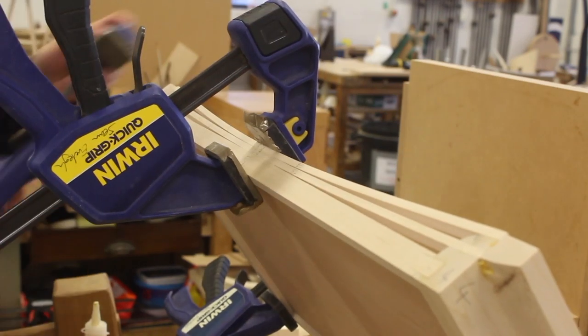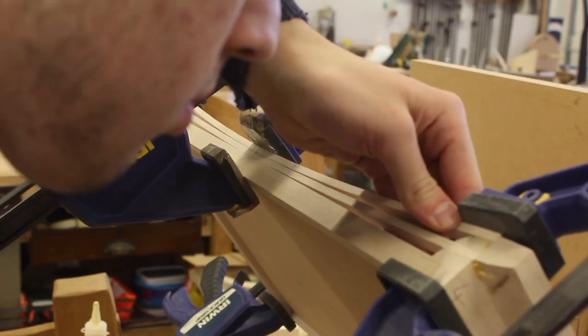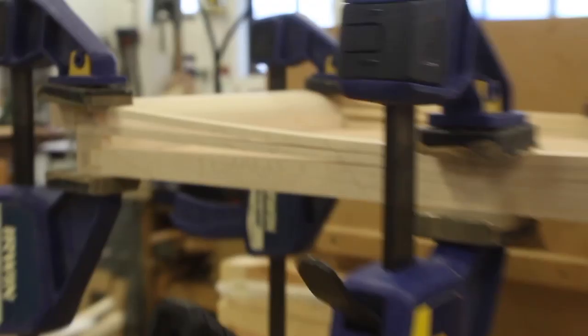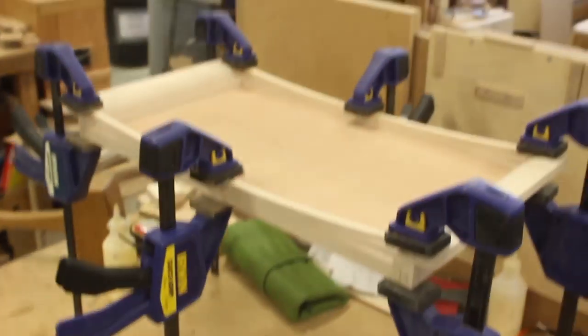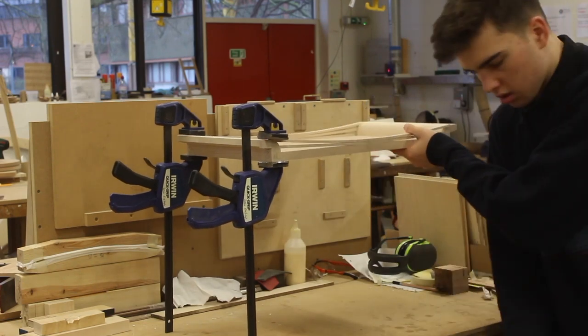those layers down. Where the clamp is, those layers get really tight, so if you did this by kerfing and steaming those layers out, it would be very difficult to sand those gaps. But I pre-sanded all of those layers before I glued it together, so I don't need to worry about that